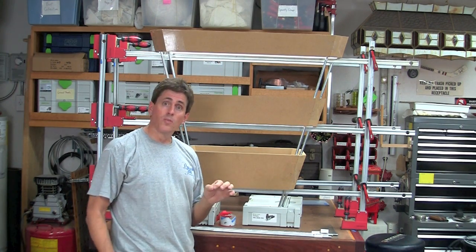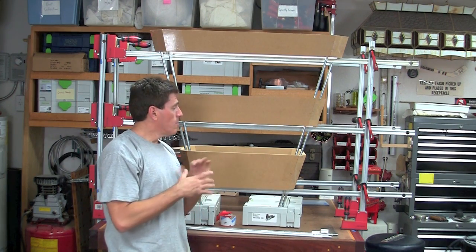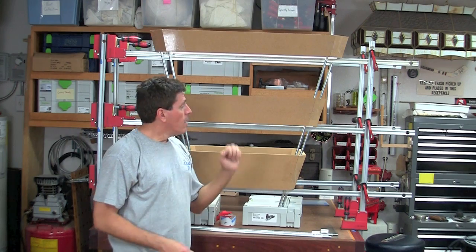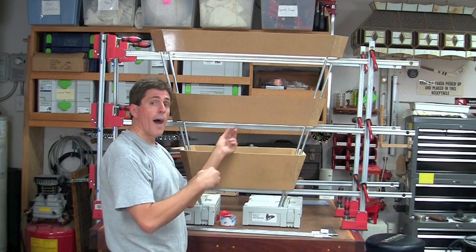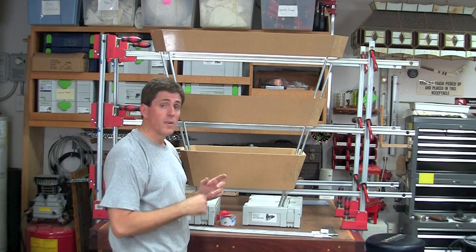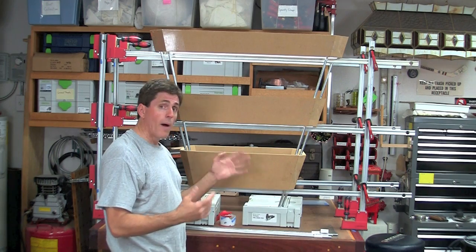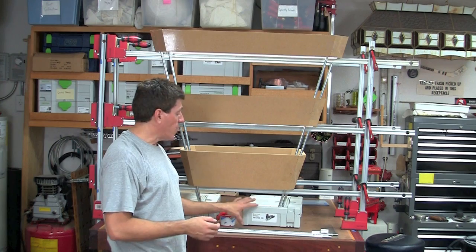Now that column, its purpose is partly a little decorative, to give it a little bit more color and something in the back, but not too pronounced. But again, this is an entertainment center. These areas are divided. There's room for a component here, here, and here, and of course on the top. All of those have ways for the wires to get into these boxes near the back, and they can then enter the column. The column is going to allow you to pass all the wires up and down so that they're completely hidden. And then the box down here out of wenge is going to have an opening in the back so that you can take all the power cords that you've got and tuck them all in there, all the excess cord, any wall warts that you have. They can all go in that box.